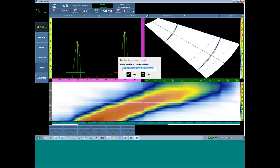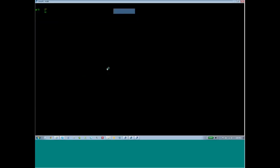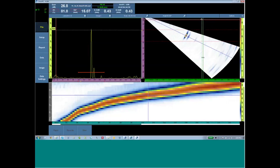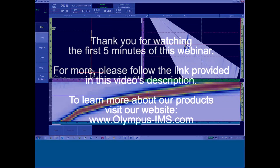We'll do a similar check for the quality of the beam using a beam profile. This is a five megahertz shear wave probe in carbon steel, and it's what most of us are familiar with. It is as good as it gets for our attempts at stainless steels and austenitic materials — it only goes downhill from shear wave in carbon steel.